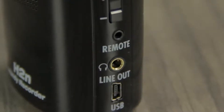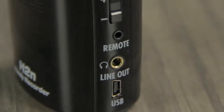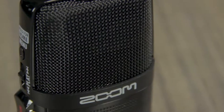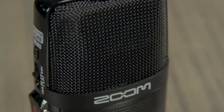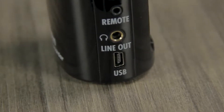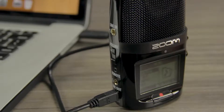The line headphone output is a stereo 1/8-inch phone jack with a dedicated volume control. Here, you can connect headphones for private monitoring. There's also a built-in speaker for fast monophonic monitoring of the recorded signal without the need for connections. The USB port also allows the H2N to be used as a 2-in, 2-out audio interface and USB microphone, as well as an SD card reader.